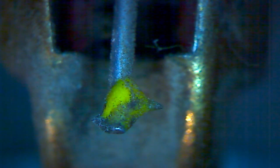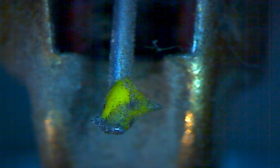So on my screen, I'm sure it'd be the same on the video, to the right is the 78 needle. Let me just focus up here a little bit, if I can. And to the left is the needle we were listening to. Oh boy. Now often the 78 one has kind of a pink color because it's made of sapphire. It's softer material. The idea being, and this is the original idea with record players, you wear the needle out, not the record. Use a softer needle. Later records made of vinyl and better materials could take the torture of having a needle dragged through them, and so to extend the life of the needle, they began to use diamond.